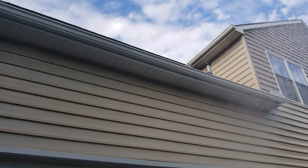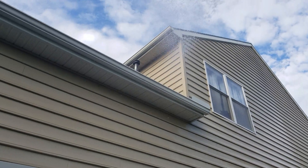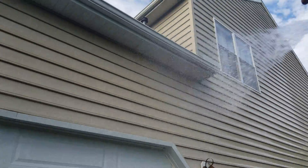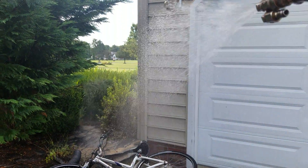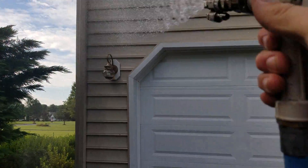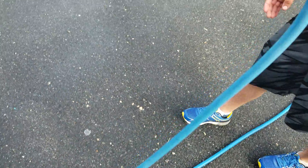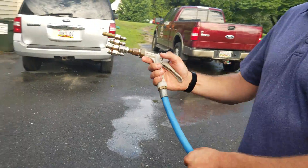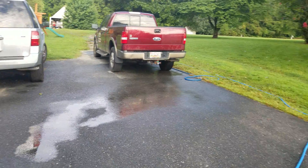You can see we can get most of this up here — and get all up there. That's with the booster. We do not have the pro switch on it, so that's really the biggest detriment: when you don't spray, the unloader air diaphragm can just sit there for the rest of the day and it'll just burn some gas.